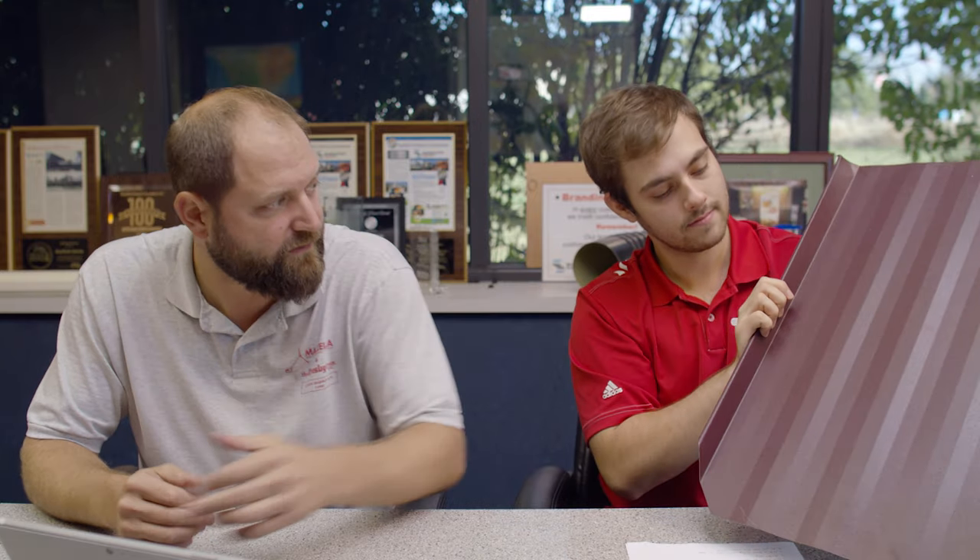Another case for putting striations in a panel: let's say you live in a hail prone area and you get some hail. With a striated panel, you have some structure to kind of break that up. So even if you do have some little dents or dimples, they're not going to be as obvious as on a flat panel — where a flat panel may show that denting and dimpling standing out like a sore thumb, whereas striations will in many cases conceal it a little bit more.